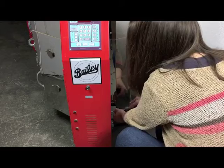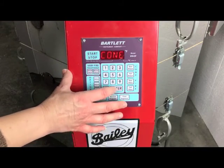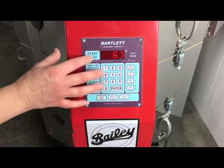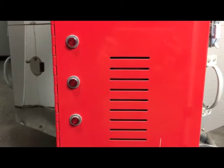When the elements have been replaced, it is recommended that the kiln be fired empty to cone 6 before proceeding with your regular firings. This will seat the elements more deeply into the grooves and oxidize them to protect them from corrosive materials in the kiln.